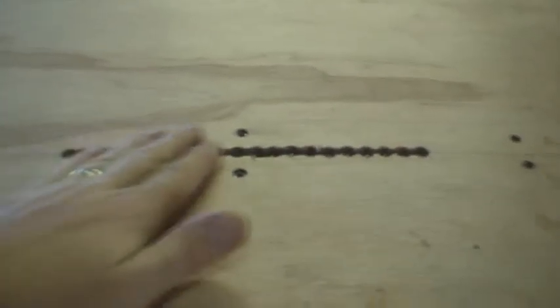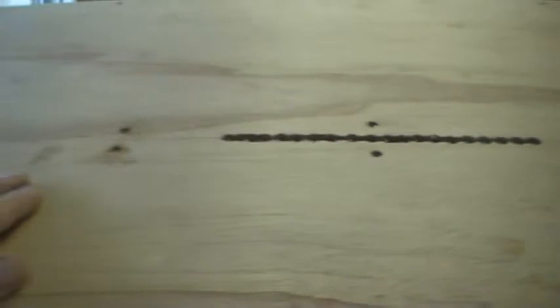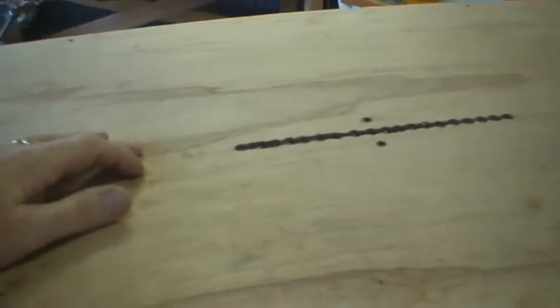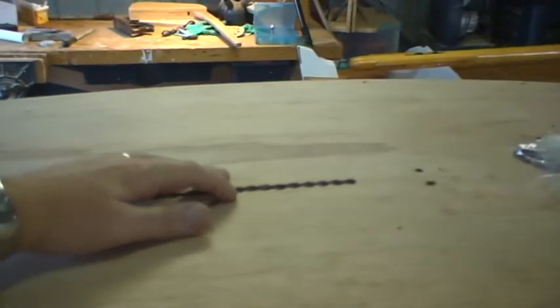The bottom of the boat is now glued on. Before I glued this on I measured out and cut the slot for the centre board, basically so I would know where it is. When I put the bottom on I put in six screws — two at the forward end and two at the after end. These screws line up to go underneath with the edge of the centre case, back into where the centre case wraps around the girders and the packers, and a couple more in the middle.